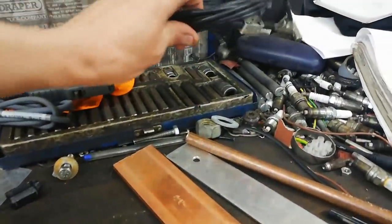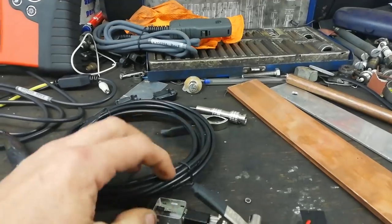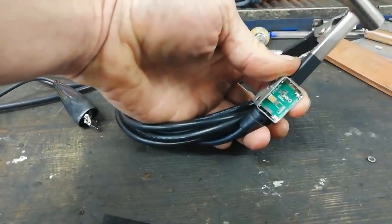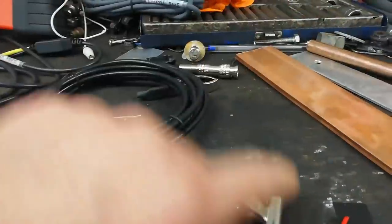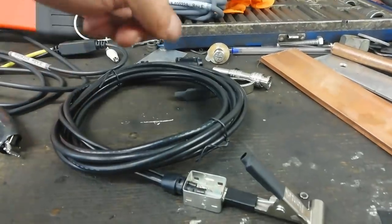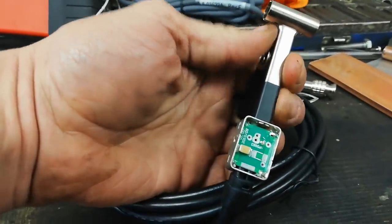This is a secondary pickup that goes around the lead with that clamp. I've taken this apart to see what's going on and whether it's protected or not. There is protection in this lead. What we've discovered is that instead of there being a resistance in the lead, that clamp is directly connected to the core of the BNC - there's no resistance between them, so that is directly through. It's a one-to-one. However, the protection lies in here - that is a capacitor.